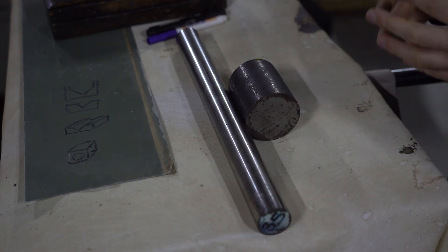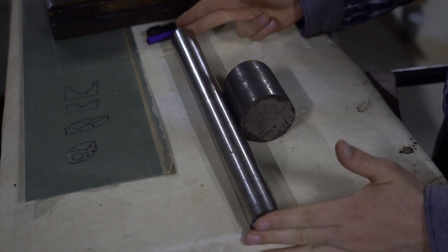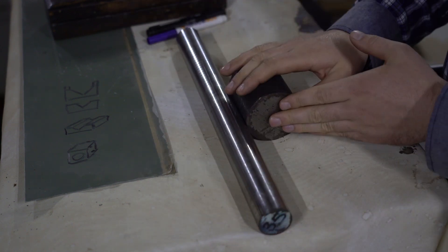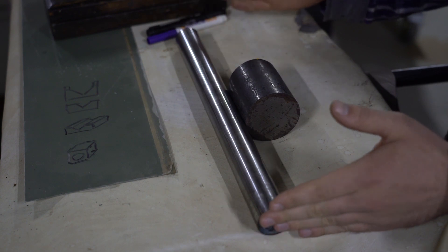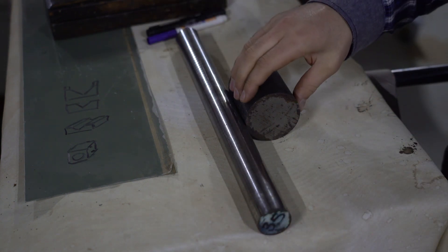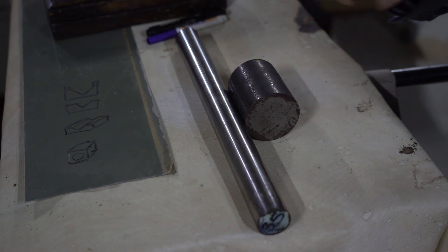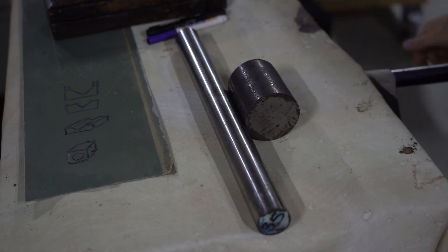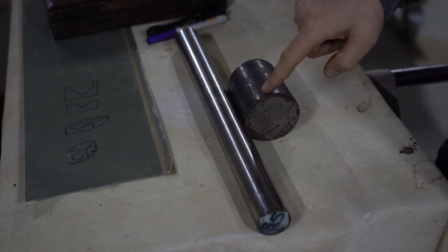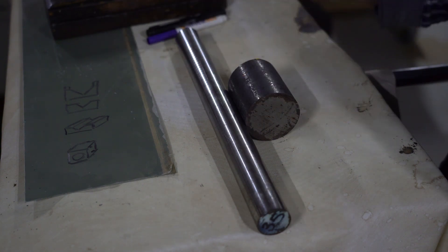So this is what I'm planning to make it out of now. Before I was going to make it all as a single piece, but now I'll be making it out of two separate pieces. This is going to be the shaft extension, and this piece is going to be the clamp that joins the shaft extension to the grinder itself. This piece isn't quite big enough in diameter to what I really need, so I'm planning to bore it off-center to give me more metal on one side than the other. That should just give me enough metal to drill and tap to put bolts in to turn it into a clamp.